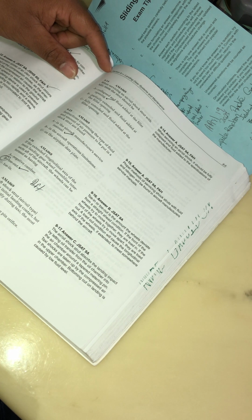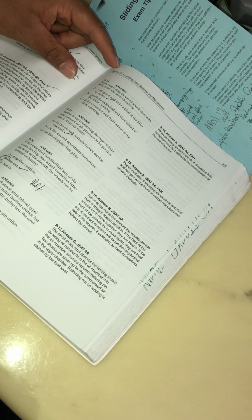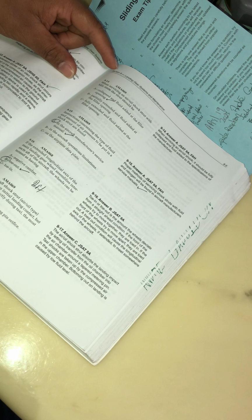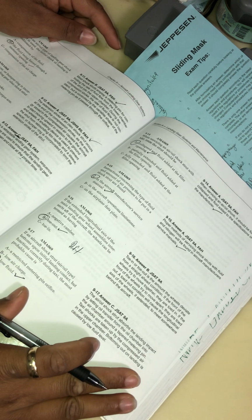Instructions concerning the type of fluid and amount of air pressure to be put in a shock strut are found in the aircraft manufacturer service manual. The proper method of servicing shock struts with fluid and nitrogen will be found there. When servicing an air oil shock strut, it should be fully collapsed and the fluid added to the specification of the manufacturer at the filler openings.